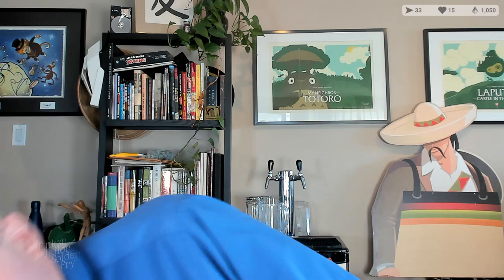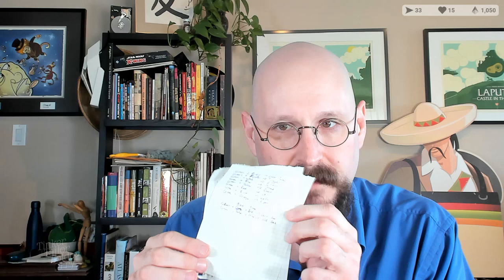Previous episodes have seen us diving deep into said joystick, removing the ADB cable, Apple Desktop Bus, which eagle-eyed viewers may notice looks a lot like S-Video. It's not. It's Apple's desktop bus. So we cracked it open a long time ago, and we did the mapping necessary. This is probably unviewable thanks to how blown out everything is. Let's see if... Aha! Shadows help. So yeah, we know that the green and the gray wire go to the lower thumb, the green and the purple wire go to the trigger, the green and the white... I get the feeling that the green wire might be the ground.